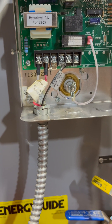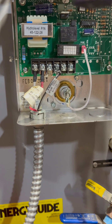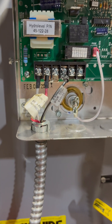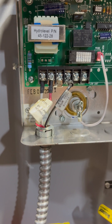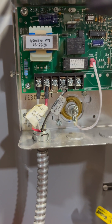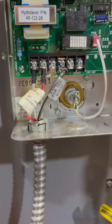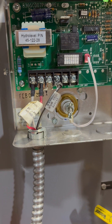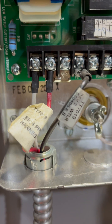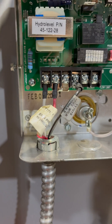I forgot to mention - I did cut the power at the beginning, so I was pretty safe, but these two terminals here, the red and white, at least on modern Peerless boilers and maybe many others too - this is a 120-volt cycle guard. It's seeing line voltage even before the boiler does, because when it cuts out it's cutting all power to the boiler. It's not messing around with just 24 volts AC - this is line voltage right here. Definitely power down your boiler before you open this thing up, because there's deadly voltage sitting right there. Fair warning.